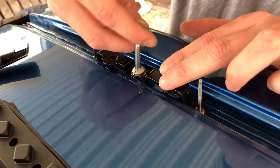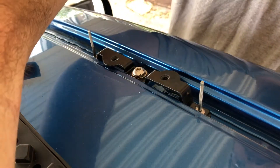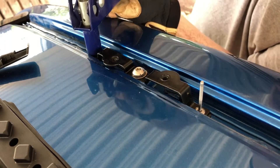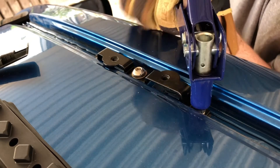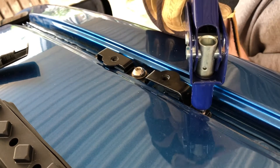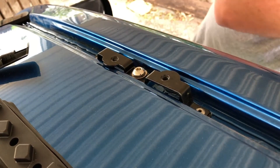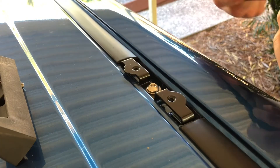I'm just cranking this screw down so that way the bracket is sitting in its correct location before I put those rivets through. So I'm using a hand rivet. The instructions do say pneumatic — I do not have one of those and I did not want to buy one purely for this. I'd recommend it because this was hard, hard work on my hands. But just with a bit of perseverance I was able to get them all through and they snapped off well. Once they were all in, I went the whole way around. I had sore hands at this point.